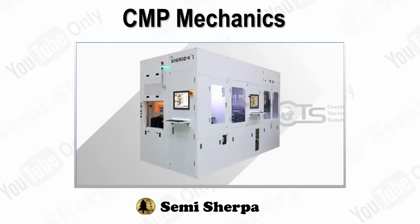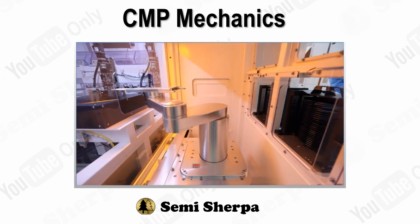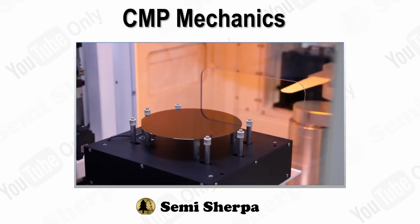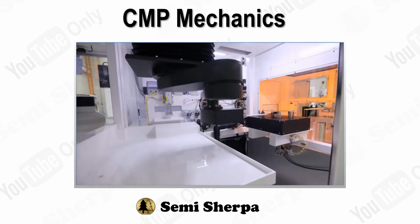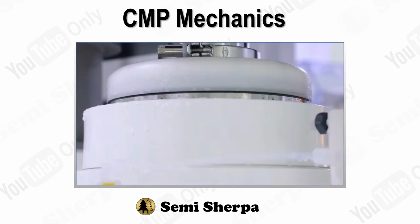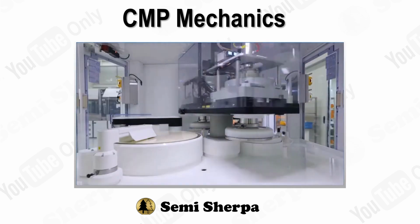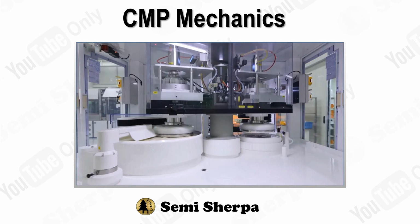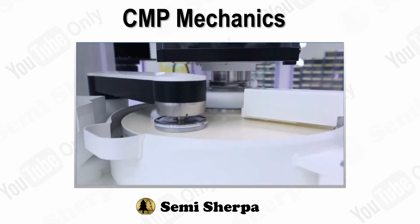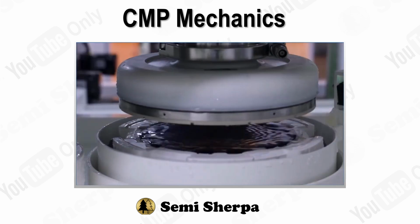Next, we'll examine the CMP polisher module, focusing on the latest state-of-the-art CMP polishers from Applied Materials. In this section, we'll cover basic CMP mechanics, explaining why the platen and head rotate in the same direction and speed, the role of the retainer ring, and how multi-zone pressure control is applied to the wafer.